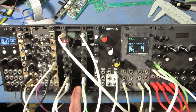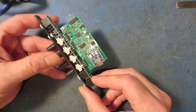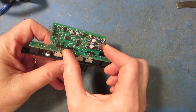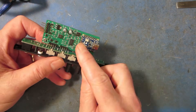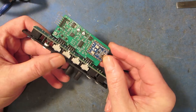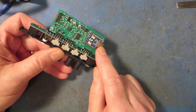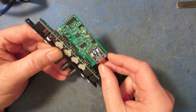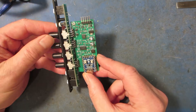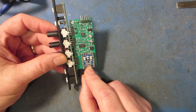Let's take a more detailed look at the hardware. This is a WaveShare board — it's like a compact Pico. It has about 20 GPIOs on it, and it worked very well because this thing has to be pretty small. This is a Pico 2; you can also get the RP2040 in the same form factor. I chose the Pico 2 because it's got significantly more compute power, which is important when running code like the Mutable Instruments Rings code — quite compute intensive. In fact, I had to overclock it to 250 MHz to run that Rings patch.